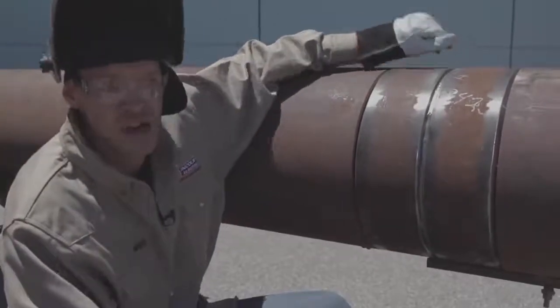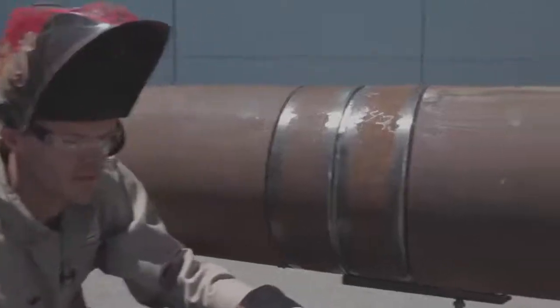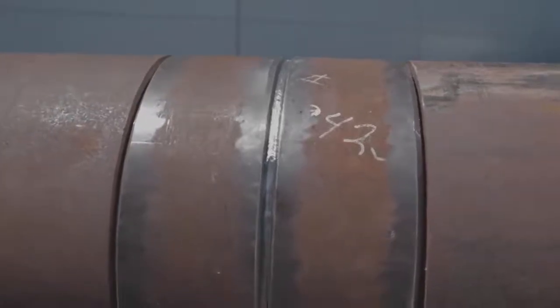So let's fire off and see how it goes. All right, here we go. Coming in — just going to touch and go. A little bit of manipulation on the electrode. Lengthening my arc. Paying attention to the puddle and the slag, keeping it back. And really letting that puddle tell me what to do.